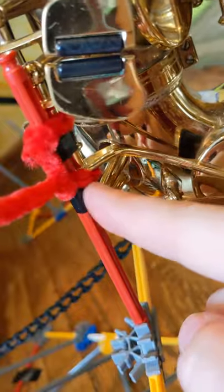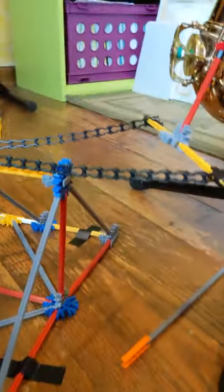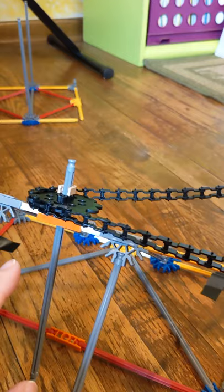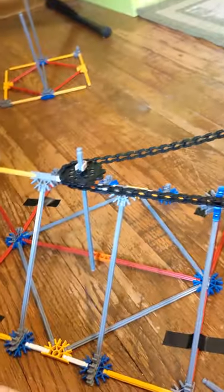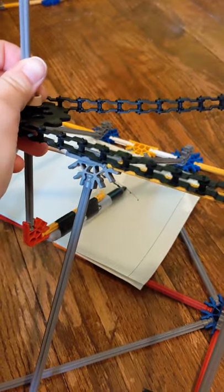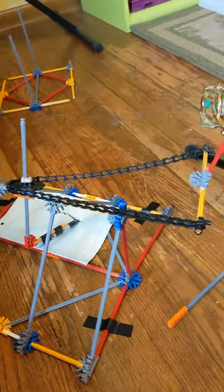The other thing that was cool about this design is that I was able to bring the arm down and match the height of the gear, which reduced the amount of slipping on that end. However, this design still isn't working great because the gear is just not the right size to produce a large enough stroke. I was able to simultaneously fix the friction problem at the saxophone's axle and the slipping by simply lowering the lever arm, which tag-teamed both of those problems and allowed me to press on to the next stage.